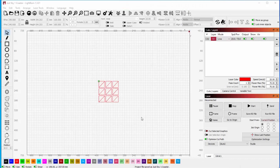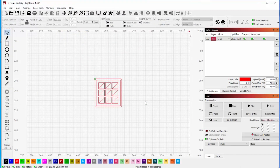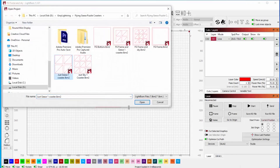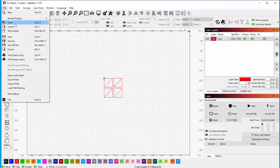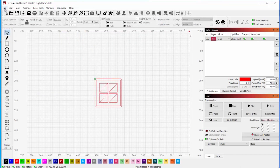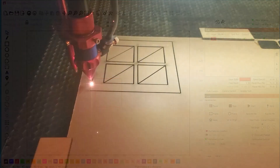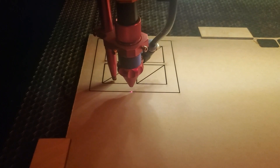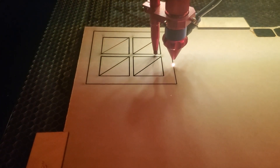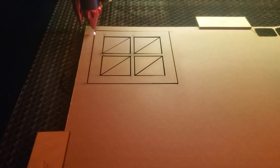For the actual cut sheets, I had one sheet that was all of the sky units for one coaster, and a version with the frame around it for cutting the black acrylics. I also had a geese-only cutting sheet and a geese-plus-frame cutting sheet. The final piece was just the simple background used to cut white acrylic. I used 3/16-inch acrylic for all of this — it feels really nice in your hand, and I had a lot of that acrylic left over from my token work.